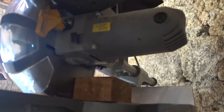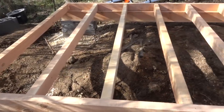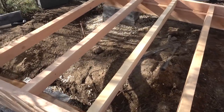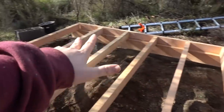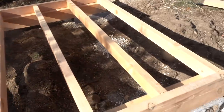It's basically ready to go for the side walls, which is like actual cabin building — the excitement is real right now. We've cut all of the middle beams and they all fit in wonderfully, measured out 16 on center. Looks really good, nice and sturdy. But before we connect all the pieces together, we need to sort out underneath — level it all out and fill in all these gaps, and then we can get this frame connected.